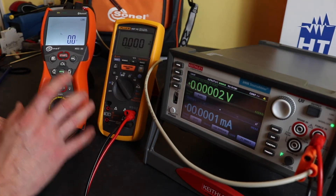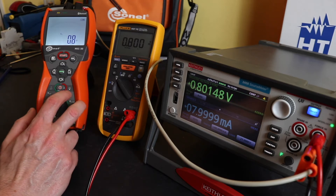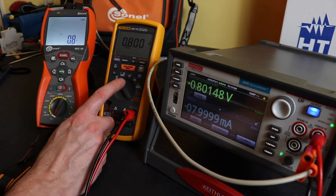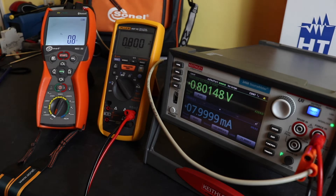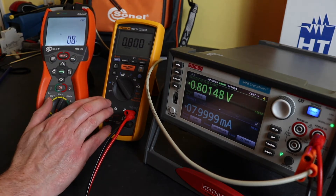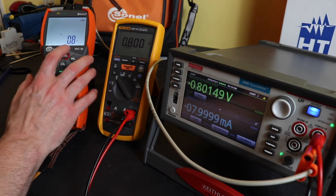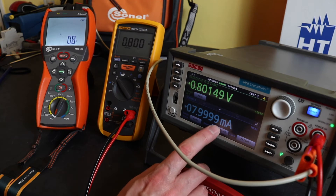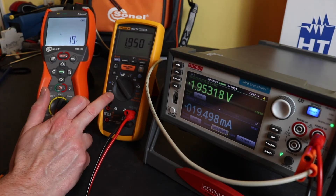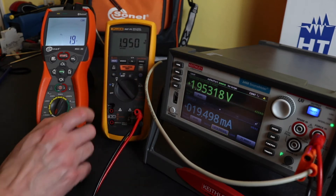The second element of concern is the resolution of the instrument. I've set up the Fluke to operate in the same manner as the MIC30, using the voltage function across the load resistor to measure milliamps. I'm kicking out 8 milliamps — I've got 8.00 on the Fluke and 0.8 volts on the MIC30 — however I'm missing two decimal points on the resolution in comparison to the Fluke. I pick 4, 8, 12, 16 and 20 as test points, so when you have one resolution it comes out quite accurate.